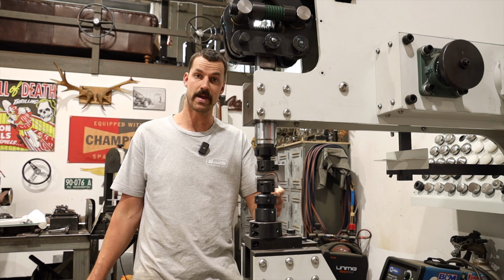Alright, so I sat on the sandbag with the hammer and dolly and just did various kind of techniques in order to try and really clean that radius up, and I'm super happy with it. I just ran over with the DA and the 80 grit just to kind of take a few tooling marks out. I've got it into place. I've squared it all up sort of where I want it, as far as lines go, and making sure that everything is, you know, kind of where it should be.